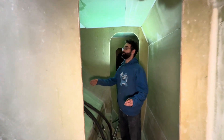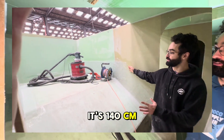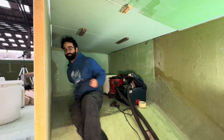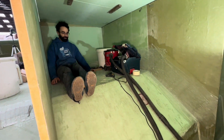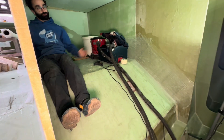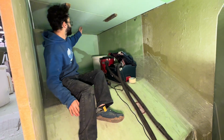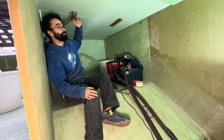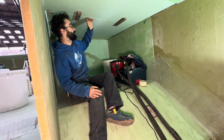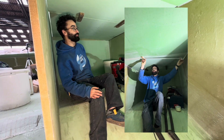This is basically the area — before in my last video it was all uncovered, and now it's covered, which is nice. This is the area where the beds are — we'll sleep on each side, and the bed will come out to about here, two meters long and 140 centimeters wide. To align all the panels I've added some temporary blocking that's screwed in, which just keeps the panels aligned. Next will be adding the thickened epoxy in the middle and then fiberglass on both sides.